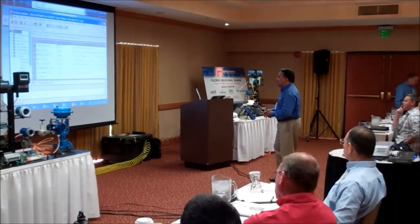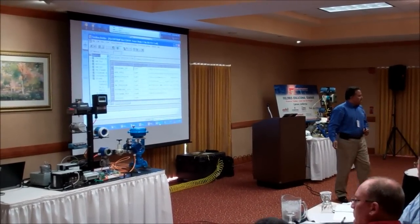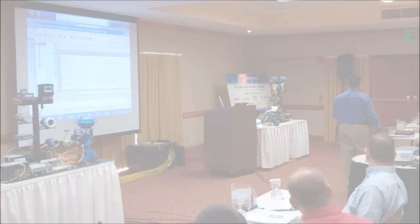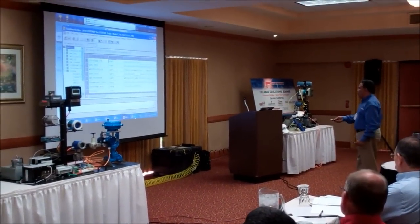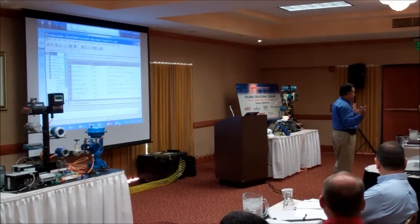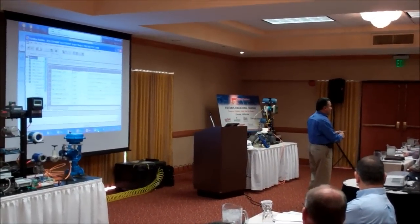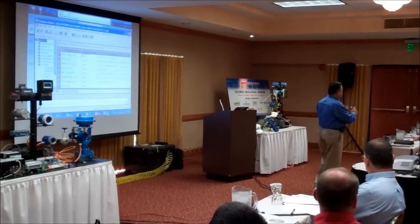Now what we are planning to do is add this DVC-6000 valve to my existing system. When you look at the system, that valve does not have any device ID assigned yet because we don't know what the device ID is. You can see over here I do not have any identifier, but that's the folder or tag address I've assigned in the system. When I put this device on the segment, it may have a totally different address. But during the commissioning process, the MAC address or device ID is going to be the same, and then I will assign the name and address for this specific segment. Right now, my device revision is 2 in my offline configuration.